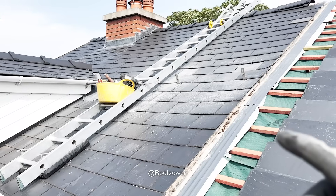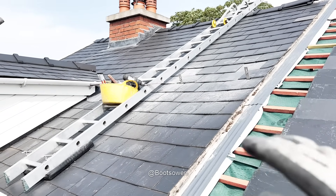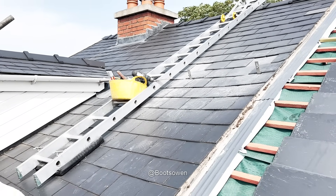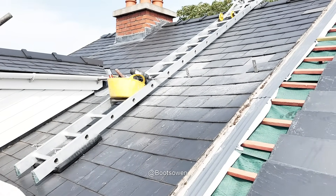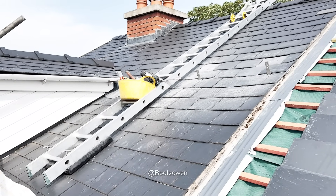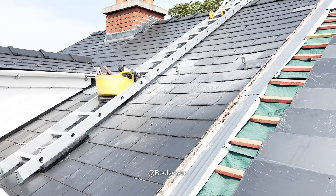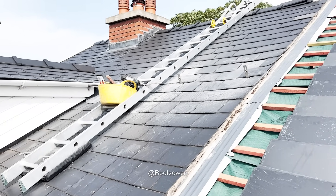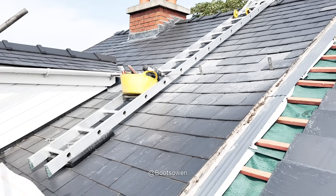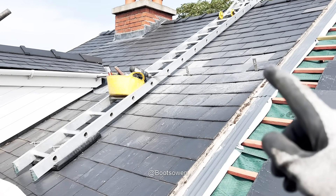These brackets — you'll see them in a minute — they're just an L hook. You have to flash above and below them and they look really neat. The dust is just from cutting the slates with a grinder. I rip the slate above out with the ripper or the slater's rip, then work down a block, cut out the slate below, tuck up a bit of lead, put the bracket in, put a washer of roofing batten so the bracket doesn't kick, and work from there. I've never worked with slate before but I'm finding it relatively easy. I spent yesterday doing my prep, getting tools together, and today I started early — it took me an hour and a half to get the first one in.